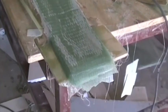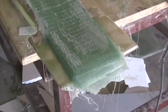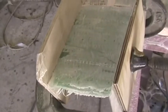Here, the third spar cap is complete. I'm going to turn it over and remove the plywood temporary ramp and prepare the other side. Here's the last spar cap ready for laminating. Just going to thoroughly sand that trough all the way down, put the cotton flock in, and lay up the final spar cap.